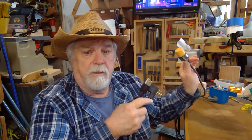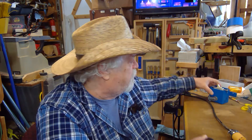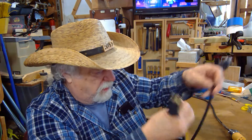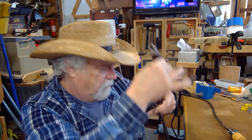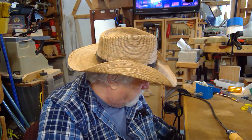What I did was cut these cords off — they're 10 feet long — and I put a standard plug on the end, so now I have a 10-foot extension cord. And on this one, I just put a small box and a switch on it to turn it on and off. So that controls this end. Now if I take this end of my extension cord and plug it in right here to this outlet, I have power here.